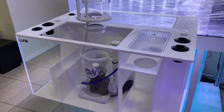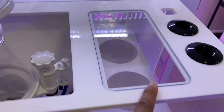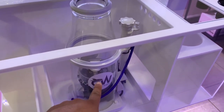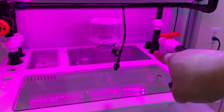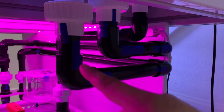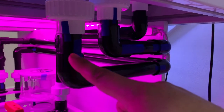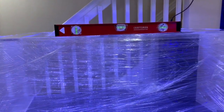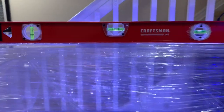Just wanted to give a quick overview of how the filtration will flow. It's going to enter through a one-inch drain — this one will be the emergency — into the filter sock section. From there it enters the skimmer section. You can see the initial phase of the plumbing is done. I did leave open the back bulkhead — that's going to be where my frag system is plumbed in. For now I've taped off all the elbows and connections to show me the direction each pipe needs to turn and how far in I should push the pipe. We also have the leveler in place — doing a dry run with no water just to check, and we're looking pretty good.